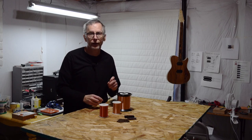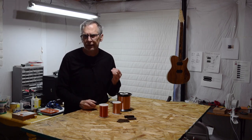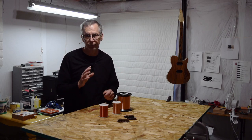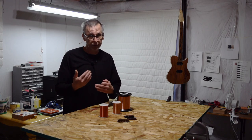The two most important factors to consider when selecting coil wire for a pickup are wire gauge and the type of insulation used to coat the wire. Let's consider the first factor: wire gauge. Pickup makers tend to favor 42, 43, and 44 AWG wire. AWG stands for American Wire Gauge and it's the most common way to refer to the diameter of a wire.